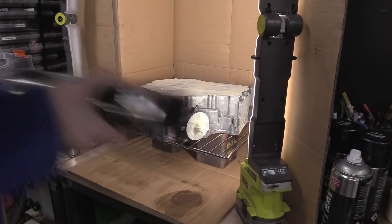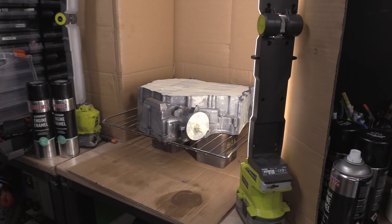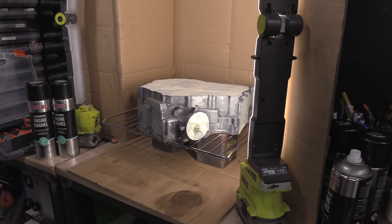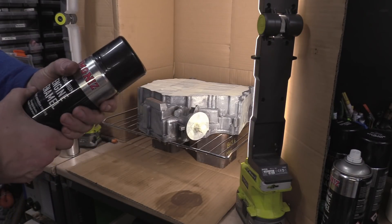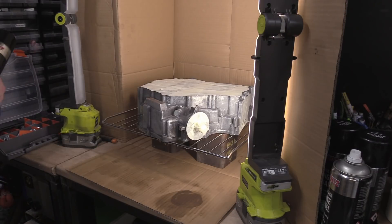It's been really cold the last week — about four degrees outside — so I've had the paint cans warming up near the log burner, which is amazing. Get yourself a log burner if you've got a garage bigger than a single car garage. When it's cold the aerosol balls stick and it doesn't spray properly. In here it's about 21-22 degrees — lovely.